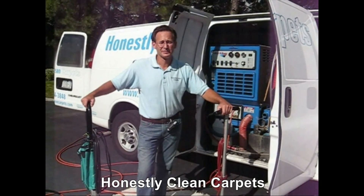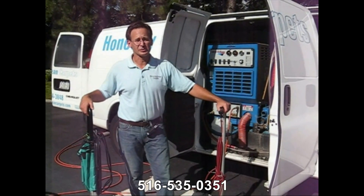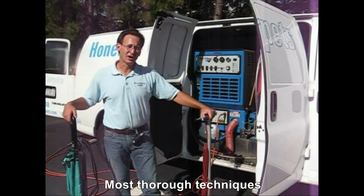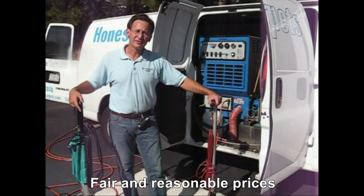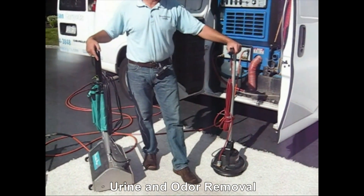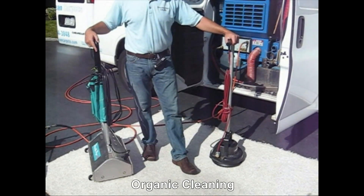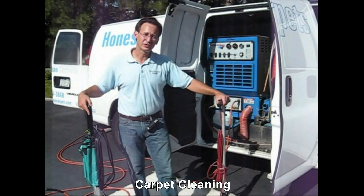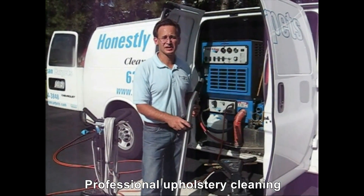Why is agitation important? Think of when you do a wash in your washing machine — you close it, saturated with water for 15 minutes, and it's really churned up good to loosen up the soil. Same kind of concept on carpets. We don't have the luxury to put the carpets under water for 15 minutes, so what we want to do is use the best processes around to loosen up that carpet soil so that we are able to extract the most amount in our extraction phase.